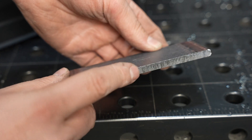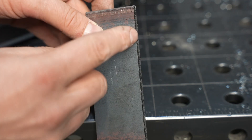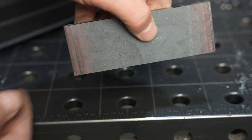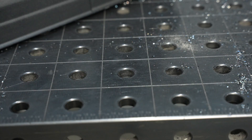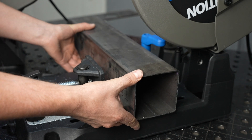Once again, a nice clean cut — basically no burr on there. One thing I look for when cutting down vertically is whether the blade will wander off, like my abrasive saw always used to do. Not at all — nice and straight all the way down. The last material is some four-inch square tubing with one-eighth-inch wall, set in the flat way.